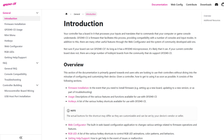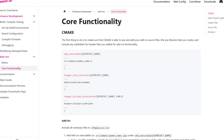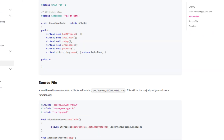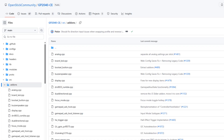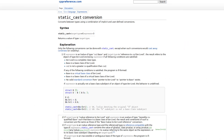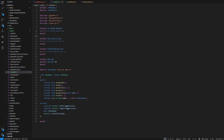While that was printing, I started setting up GP2040CE. After reading through the docs — which are unnecessarily complicated to navigate and rely heavily on the text search tool — I concluded I'd have to modify the firmware source code to make an add-on for the speed measurement system. It turned out there wasn't really a guide for how to code an add-on, plus they were in C++, which I've never properly learned. So I had to go to the GitHub repo and decipher how things worked from the existing add-ons, learning the necessary syntax on the go. Once I thought I'd figured it out, I cloned the GitHub repo to build my own firmware, added my add-on files, and came up with this code.